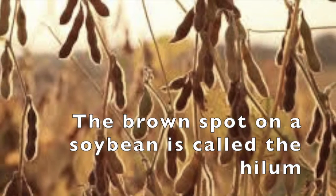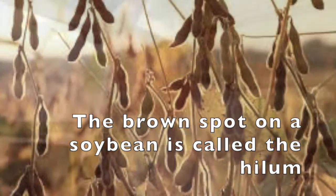A bean plant while it's planted in rows, the rows are a lot narrower. And so we have to take the whole plant because there's beans all the way up and down that stalk. And so the whole stalk of the bean plant comes into the bean head and into the combine and goes through the combine to be threshed out. And so the head has to be made differently because the plants are different. And where the seed is at on the plant is different.